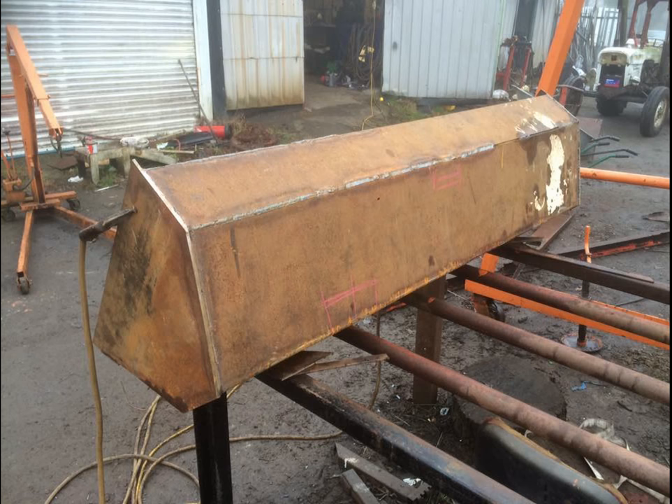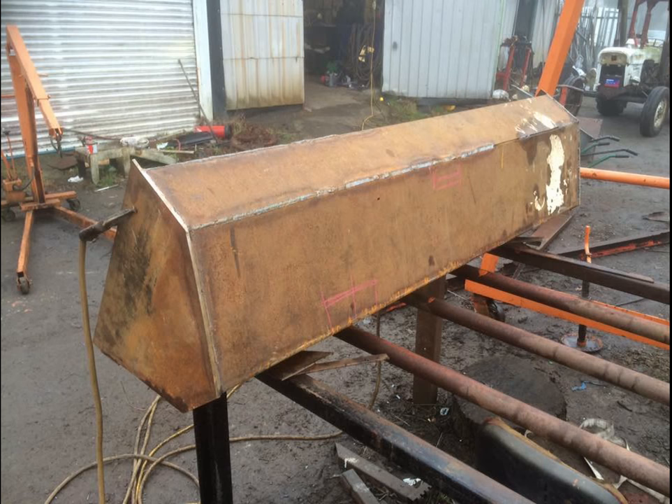Alright, so I'm welding the back now, just showing you by there. Like I said, 3 passes in each one of the cuts of weld. So here's the front cutting edge - that's like 18mm thick with three plates, two plates underneath and the original plate.